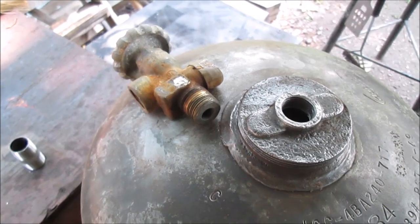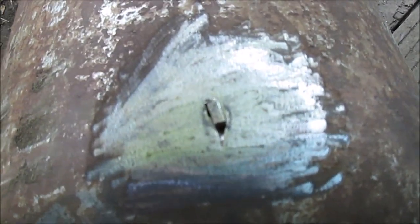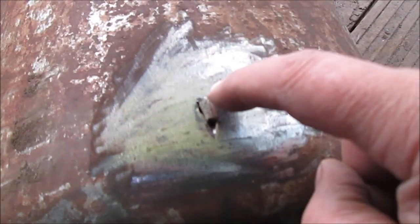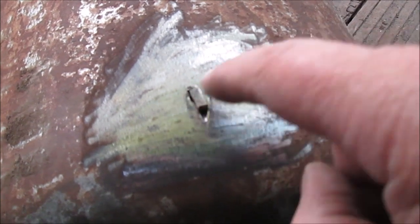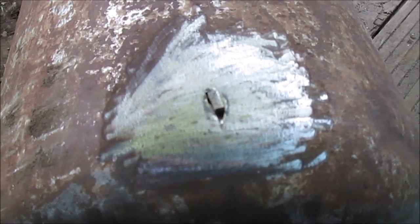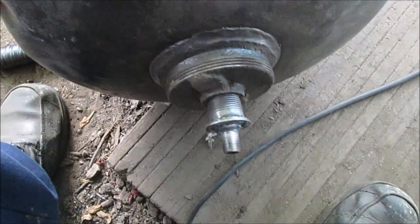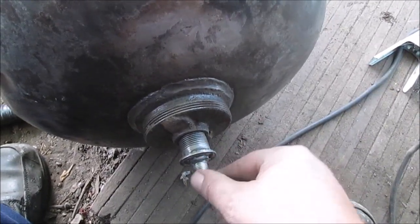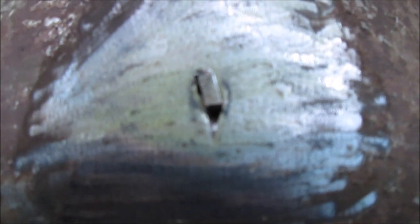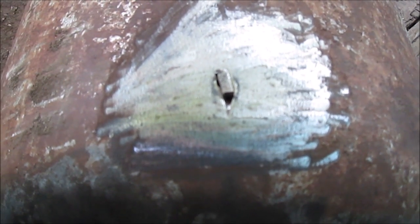We're welding the holes up. We got a patch on that one - see where I pounded a little piece of metal in there, like a little triangle piece cut off something to plug the hole so it's easier to weld. We'll weld the perimeter then start filling the hole. We'll grind in between - weld, grind, weld, grind. It's only going to hold about 100 pounds of air, it'll be safe. We made a fitting just out of a washer to put our valve on, just for testing purposes only.